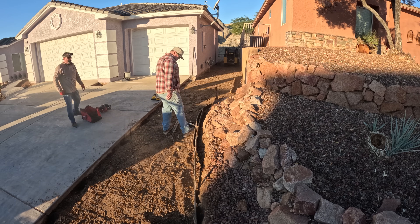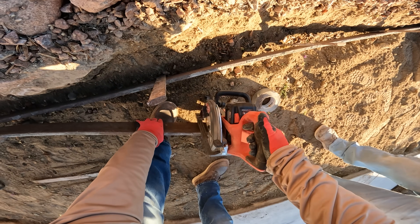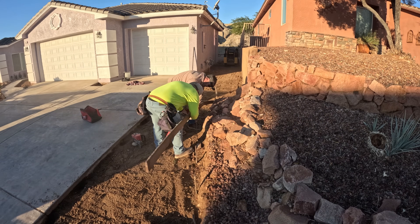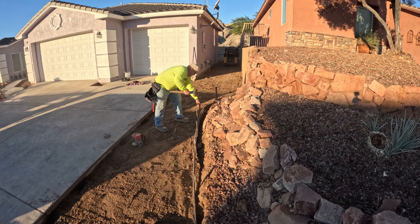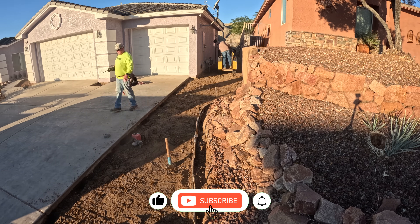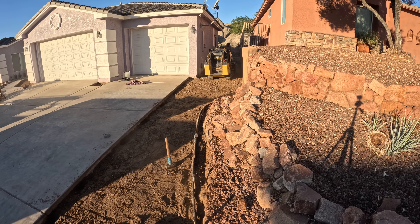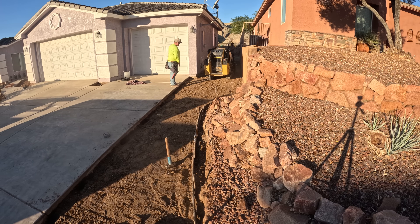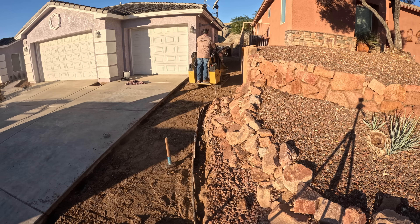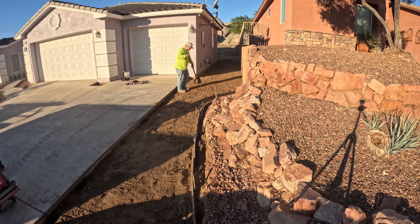After that it gets pretty drastic — probably about three feet of slope from the front of the garage to the city sidewalk. So here's how we're going to do this and maintain that retaining: we're just going to put a form bender board, hold it out just a little bit, and you can always stack some rock back in there, some decorative rock. Instead of drilling and doweling into the driveway, I'm going to actually underpin the existing drive — dig under it and do it like an earth tooth or keyway. That'll lock those two slabs together for movement.